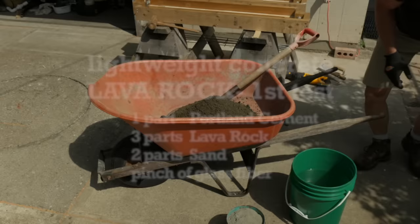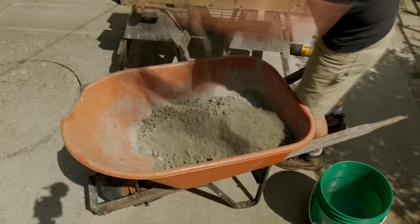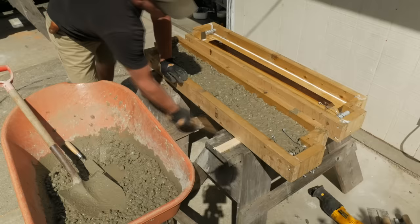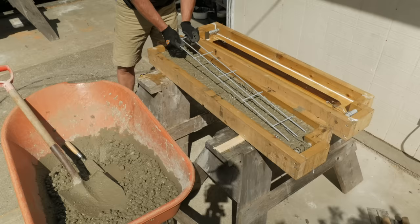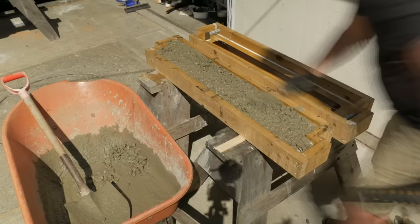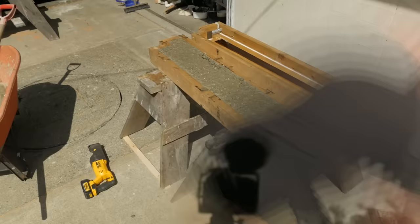These proportions are measured by volume. I put the sand, lava rock, and fiber in the wheelbarrow first and blended that before I added the Portland cement. Once that was well mixed, I slowly added water. I realized as I was doing this that it wasn't looking as smooth as I had wanted — it looked quite lumpy. I went ahead and put it in the form. I used a reciprocating saw without the blade to vibrate the form and settle the concrete mix. Then I laid in a piece of reinforcing wire mesh — galvanized wire mesh cut from a large hog panel fence from my local farm supply store. Then I topped up the rest and vibrated it some more. I tried to smooth it out with a trowel, but it wasn't coming out very well.